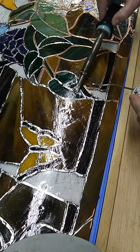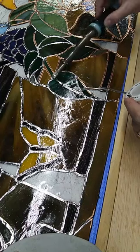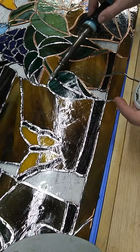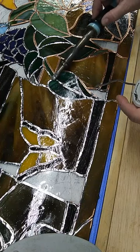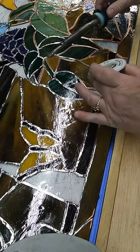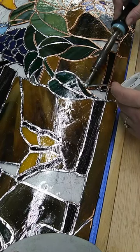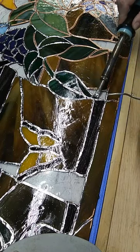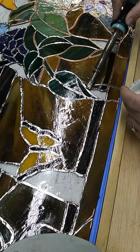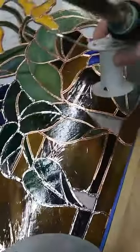When you're fixing bubbles, even when our finish soldering is happening, notice I pick my iron straight up. I don't scoop. If you scoop, you leave those sharp little barbs that cut you when you're cleaning and waxing. Always pick your iron straight up, and that will avoid those, because the solder is freezing mid-air, and that's what's giving you those little spikes. It will self-level as you go back and lift it. You'll see that a lot more when I'm finished soldering.